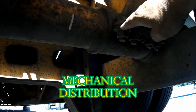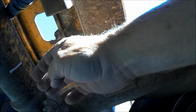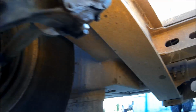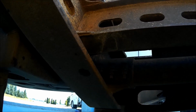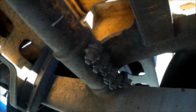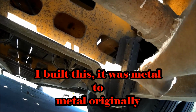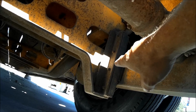But what it is, okay, here's your walking beams, and then here's your other trunnion and your shaft. And see, this subframe comes right here. And so when you put a load on the trailer, the load isn't placed all right here. It's placed clear back there. And then that pushes down on the booster, and then up through this subframe. You can see it's a pretty good size web and a flange on it, and it comes up here. And then to hold these tandems straight, those are I think like a 2-inch thick block of UHMW, ultra high molecular weight plastic.